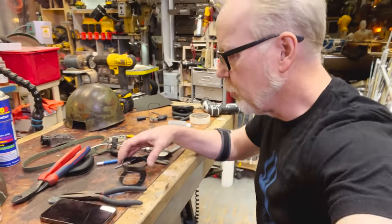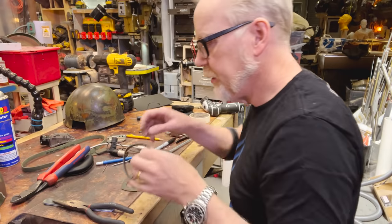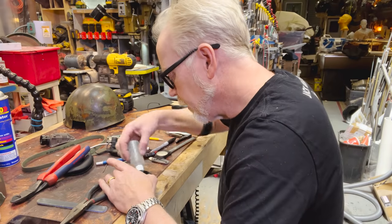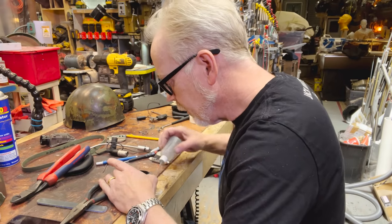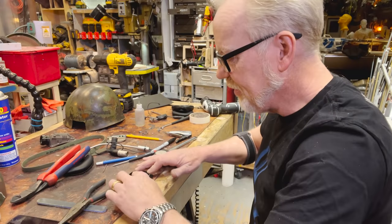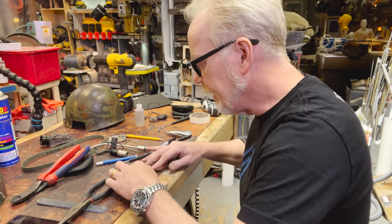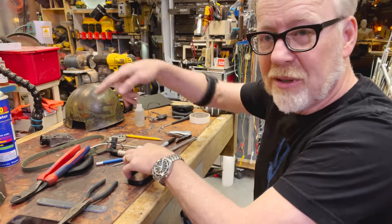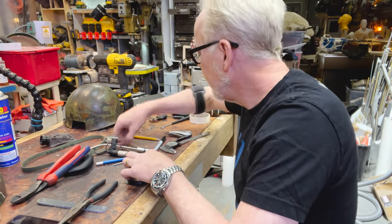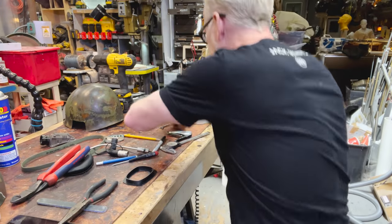All right. My little glue border here on the ear cup has set. So now I'm going to glue it in place. Now with something like this, where I wanted to have a lot of strength, because this will hold on to my ear cup. I'm gonna let this set, and then I'm gonna put a little crazy glue gusset on the inside. That'll just give me a little more security about how strong it is. And I guess I can put away the 2-56 tap.